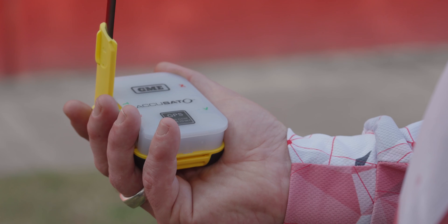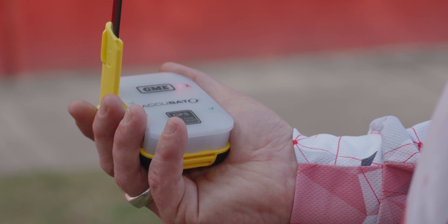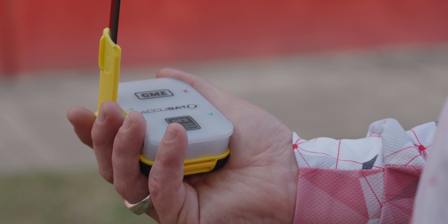Be patient — this may take up to two minutes, but keep a close eye on the LEDs. Following the successful completion of the GPS self-test, the green LED light will flash eight times in quick succession. If however the red LED light flashes eight times, that indicates that the self-test has not been successful. At that point, reconduct the GPS self-test, and if you do not receive the eight green flashes at the end of the test, it's time to contact GME and arrange to have the beacon returned to us for a proper inspection.